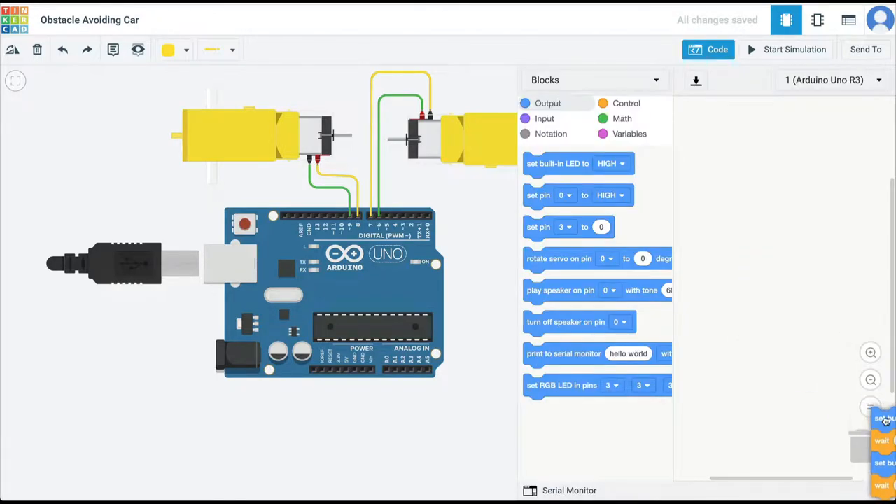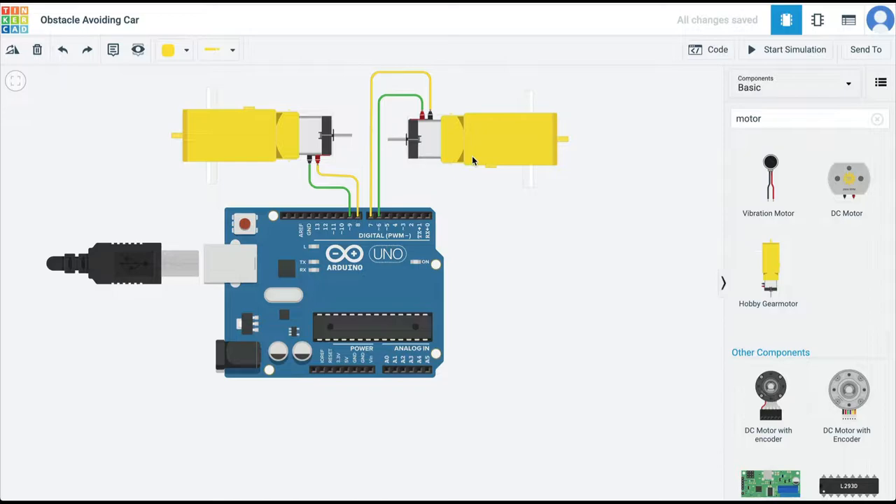The code is straightforward. To move the motors forward we need to have one pin high and one pin low, and the same on the other side. To move in reverse we have to flip the polarity. These pins are serving as a power supply — one pin becomes high, the other becomes low, completing the circuit.